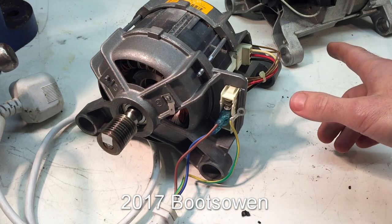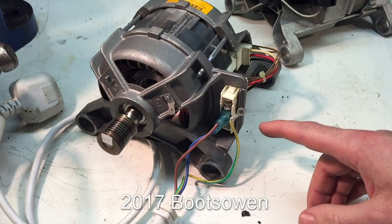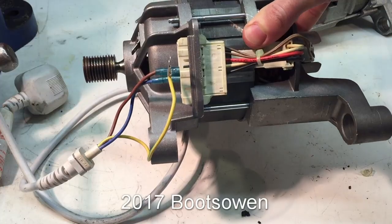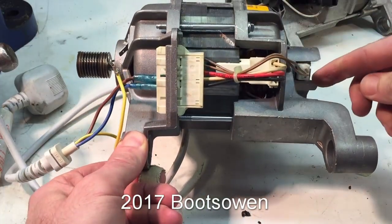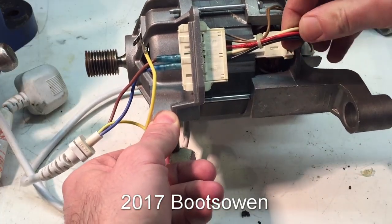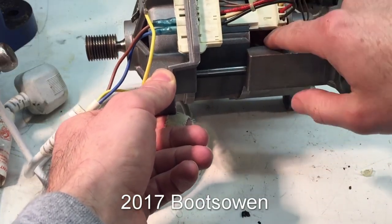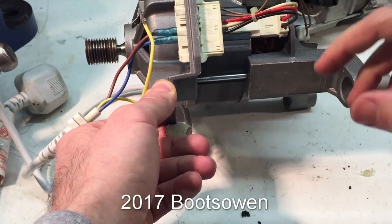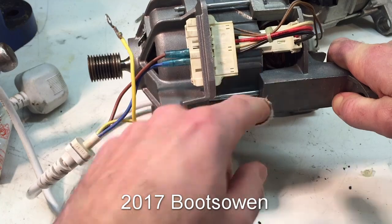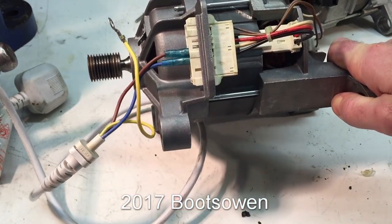So I've shown you in other videos how to wire up the universal type motor. This video is how to wire the induction type motor. You've got five cables coming into the block. On top you've got two browns that go to the tacho on the back — let's forget about those, they don't come into the equation here. Then you've got a white, a red, and a black — those are the three phases going to the armatures inside. To wire it for single phase, you just throw the live and the neutral across any two of these three cables. As simple as that. I've got it on the white and the black. Let's plug it in.